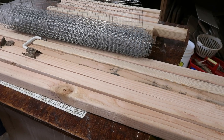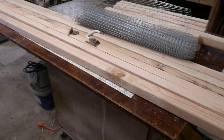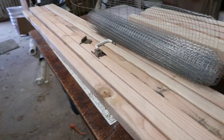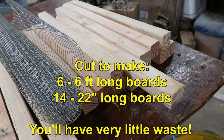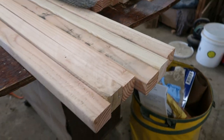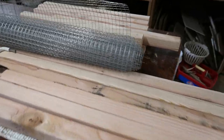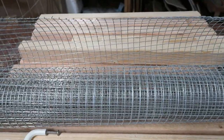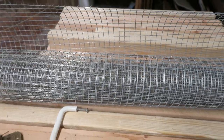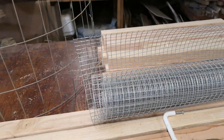You're going to need four 2x4s. When they're all cut, you're going to wind up with six 6-foot sections and fourteen 22-inch sections after you've ripped them. These have been ripped in half, so nominally 2x2s. You're also going to need hardware cloth — this is half inch by half inch. Please do not use chicken wire, as other animals can just rip right through it. Get the good stuff and build it with hardware cloth.